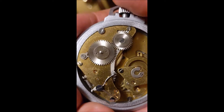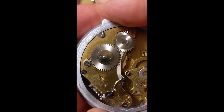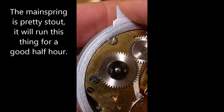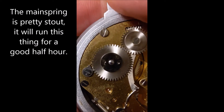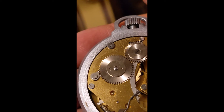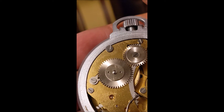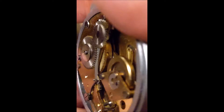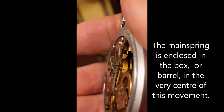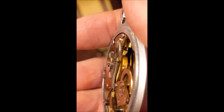There's the mechanism — the movement, if you will. That's the mainspring under this wheel right here. You unscrew that cap; you put a spanner or a set of tweezers in there and unscrew that cap, and then the winding wheel comes off. The mainspring is in that barrel. You can just see the barrel and you can see the outside barrel hook of the mainspring.